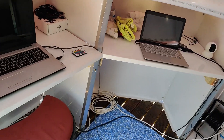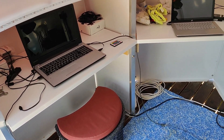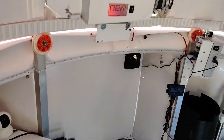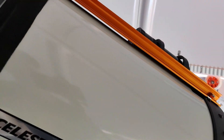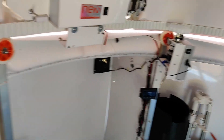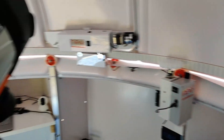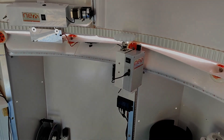That's really where we are at the moment. The usual build problems — alignment of some holes just needed a drill running through them to get things to fit together. The shutter retention kit came with a mix of the wrong type of screws, so I rummaged around in my parts bin, cut some longer ones and made them fit. Babak from Nextdome is going to post some additional ones to me. I also ordered a second track as a backup, just in case — it's better to have it rather than trying to get things shipped from Canada again.